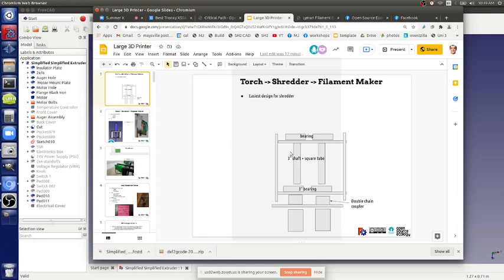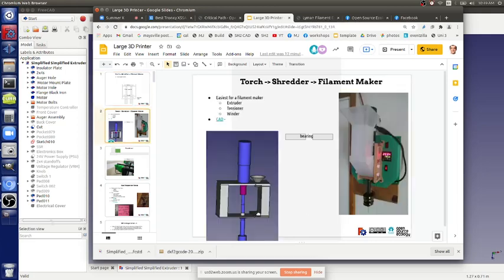Now, to scale this to industrial production, you'd have to scale it up, maybe do a bank. I do like the bank idea. Just have a bank, meaning like four of these extruders, or even do this same thing here, same chamber. Just make this a longer thing. Just have four heads popping down, same hopper. I mean, we should do something like that. Do one first. After we do the first one, then put four heads on this, because the parts are cheap. It's like $100 to $150 or so per additional head. And that gets you into four filament streams. That's getting into something that would be a business.